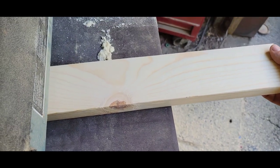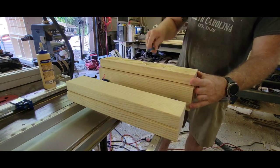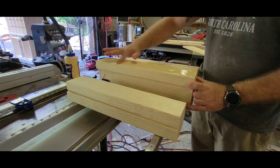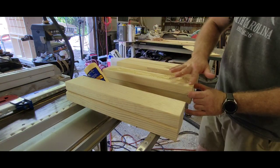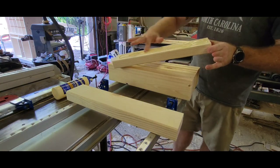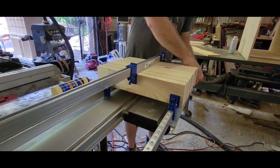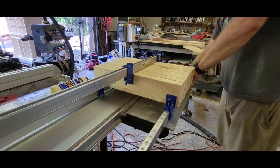Getting those center ones into place was a little bit of a struggle, but everything lined up, everything was tight. I ran some screws into the uprights from the bottom because you won't see them. Now I'm working on the legs — these are two-by-fours I cut down and sanded flush on one end, and I'm gluing them up. I didn't have material thick enough so I had to make some by gluing two two-by-fours together to get thick enough stock. It's important to make sure the two faces you glue together are flat so there's no discrepancy when you cut the shape.